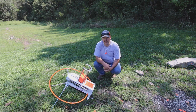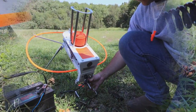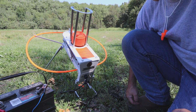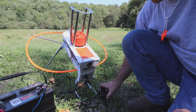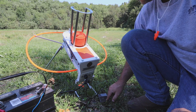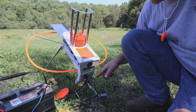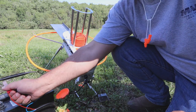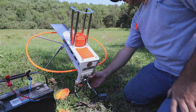I'm going to show you how to adjust this down the proper and safe way. This right here is your adjustment knob for your spring. You have a toggle switch which has an on indicator, an off indicator, and a disarm indicator. In order to adjust this, we're going to want to put it on disarm. You're going to want to push the pedal so that the arm goes all the way out to the 12 o'clock position, then let go of the pedal. You'll hear the motor is still running — turn the machine off, then unplug your power supply so this doesn't come back and bite you. Now you're going to want to loosen your spring.